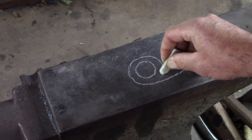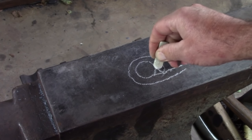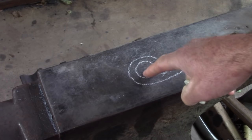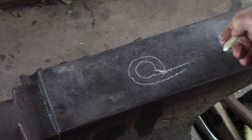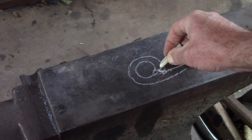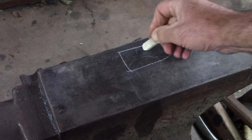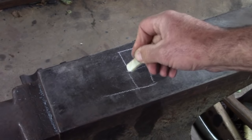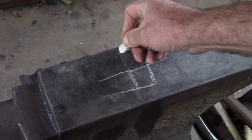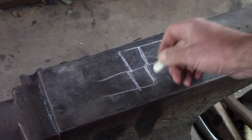Typically I like to sweeten the end so it tucks in nicely. As cut from the bar at 90 degrees, you get a little gap that doesn't give a full bearing surface, and that corner may even gall the pin or pintle. I'm going to sweeten up that end just a little bit — I don't want to over-sweeten it because that risks thinning the material. When we stack our two hinges together I want a nice flush surface; if one has been thinned on one side, I'll have a joggle in the hinge, and that's not what I want.